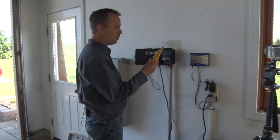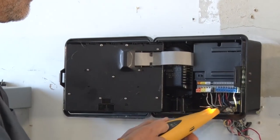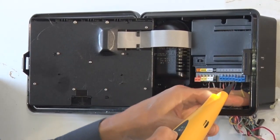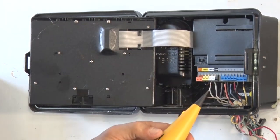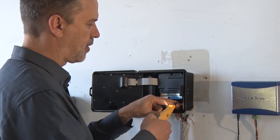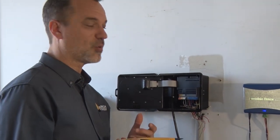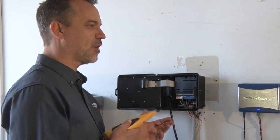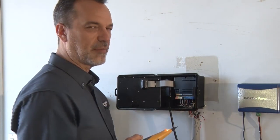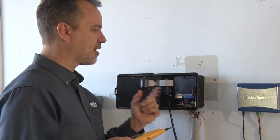Back at the clock, use the inductive probe — you don't have to touch the metal to get a signal. When near the wiring you'll hear the beeping. The probe has a metal tip: when you touch the correct wire, the signal gets louder. The loudest wire is the one connected to that valve box. Other wires will also give some signal, so don't be confused — it's the loudest one. Touch the metal tip to other metal for a stronger signal. There's also an LED indicator for darker environments.